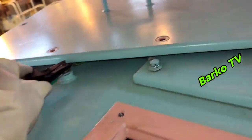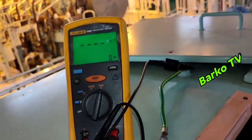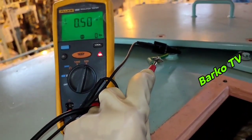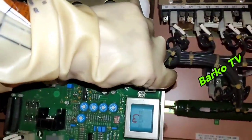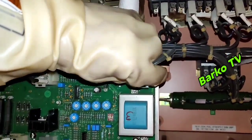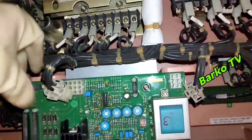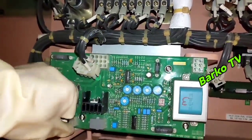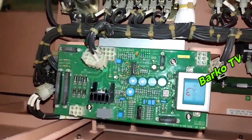We will use this Fluke — it is a reliable IR tester. We set it to 500 volts. The two probes are already connected, testing line to ground. Remove connectors x1, x2, x3 from the AVR. x1 is the most important one, but I keep reminding you: remove all connectors on the AVR to be safe.